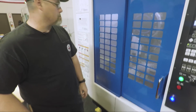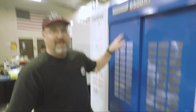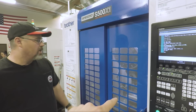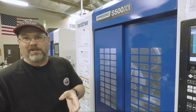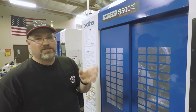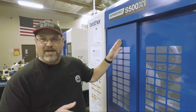Okay, so there's probably a 10 or 15k spindle to start with, and then these are 27. Wow, but it's not using the spindle at all. Some of the bigger diamond tools, the biggest diamond tool we use is 5 millimeters. That's pretty big. The smallest is 0.4. That's small. So anything above 2 millimeter, we use the 27,000.